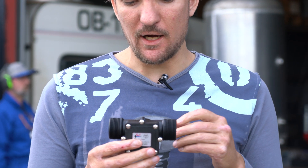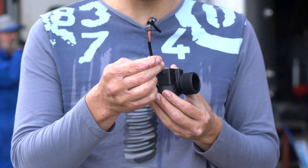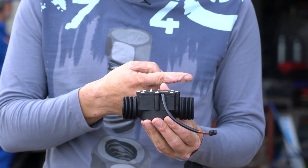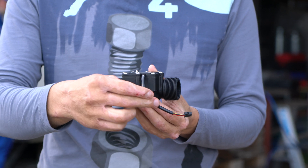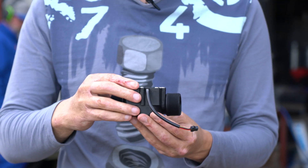What I have here is a slightly larger version of the flow meter sitting on the test stand behind me. The way this flow meter works is that there are essentially three wires that run into it, into a little contact that is rotating as the flow passes through. We then get square pulses that we can measure, which gives us a quite good approximation of the flow through this flow meter.